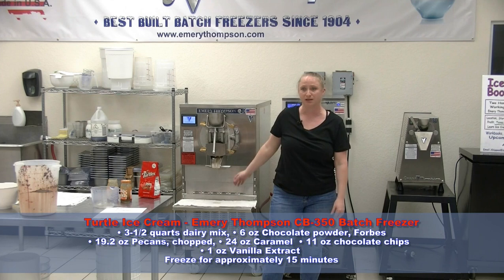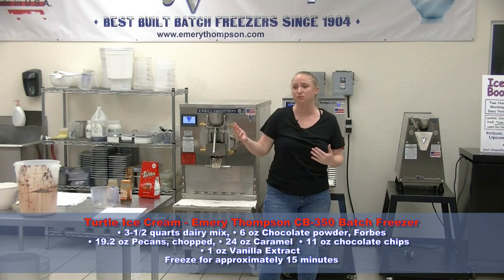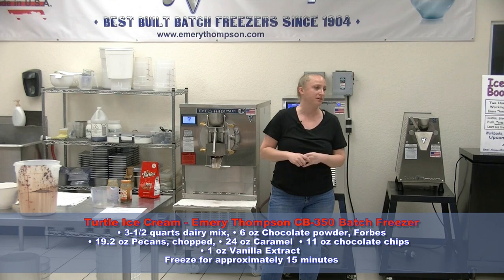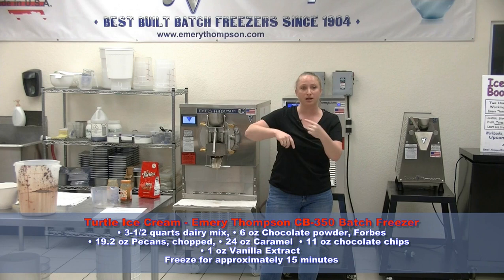An air-cooled does that. Typically, people go with an air-cooled because they have really strict water restrictions where they're at in their city. They're remote islands, they're way up a mountain where water is very scarce to get to. Places like Alaska, water-cooled machines can probably freeze over pretty quickly, with their kind of sub-zero temperatures. So preferably, water-cooled is always best. And then also, if you are wanting to conserve your water, our machines also work very well on a glycol chiller, so it can recycle the water and then come right back to the machine.